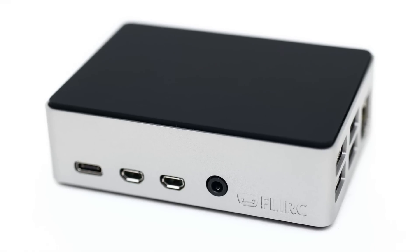It's a reliable enough compromise that I'd recommend it to anyone that wants to use the official Pi case. But if the Pi Foundation plans on making a similar case for the next Raspberry Pi, I hope they consider the thermals in the case design itself, and either build a passive heatsink into the case like the Flirc, or build a fan into the design of the case itself instead of as an add-on. If you already use the official Pi 4 case, then for $5 the case fan isn't a bad deal — it keeps the Pi from throttling and only kicks in under heavy load. But it does sound a little annoying and makes its presence known. I'd still recommend using a different case like my favorite, the Flirc case, or finding another creative way to mount your Pi 4 so it can keep cool without needing any noisy little fans at all.